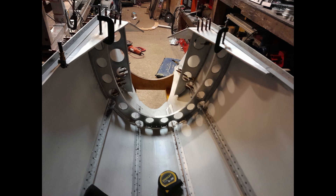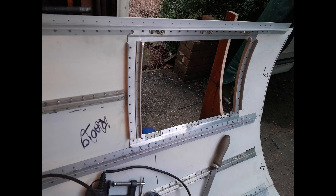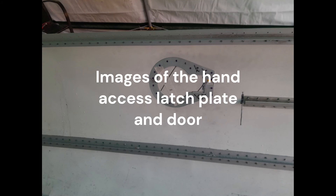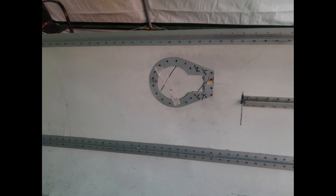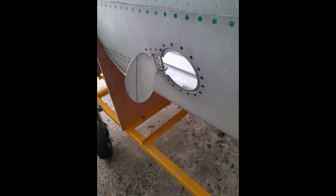At one inch pitch, this requires some 4,800 holes to be jig drilled, 2,400 countersinks to be produced and then riveted with high strength rivets. An additional 700 holes, 350 countersinks and rivets being required for the internal substructures and doublers for the various fuselage openings.